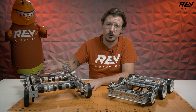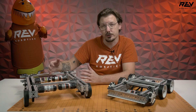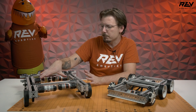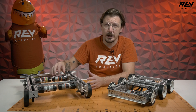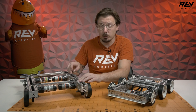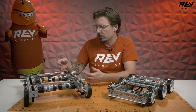Since we're only running with one HD hex motor per side of the drivetrain with our channel drivetrain, what we're likely going to do is move these motors to the middle, or possibly keep them in the back and use sprocket and chain to power both wheels, while also keeping the gears for the power transfer. We're going to see what we're able to do there.